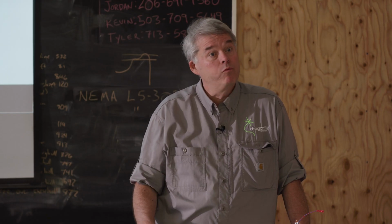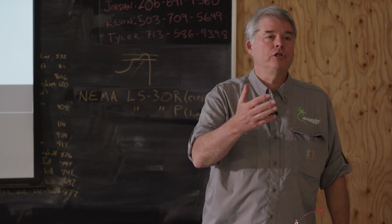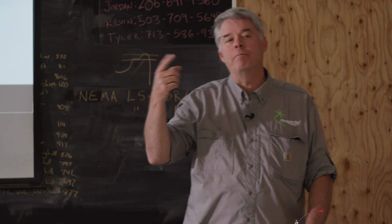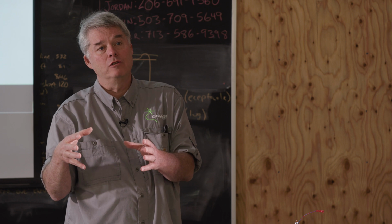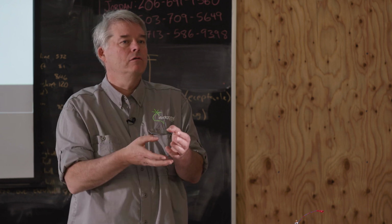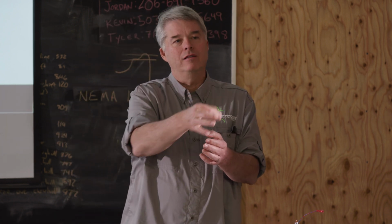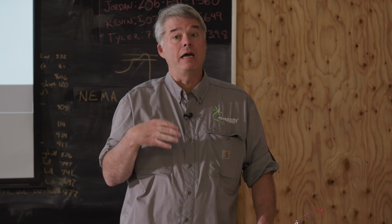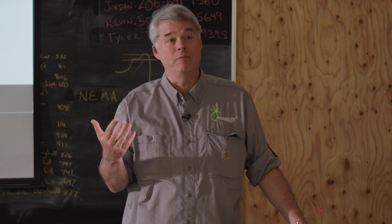We have found with lithium batteries, if we're using an analog temperature sensor, typically the positive post is better, especially with ones with built-in BMSs, because the BMS usually switches the negative aspect of the cells. So if you attach to the negative, you're going to end up knowing what the temperature of the BMS is, not necessarily the cells.